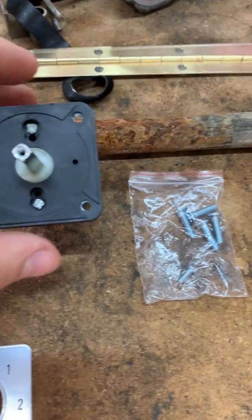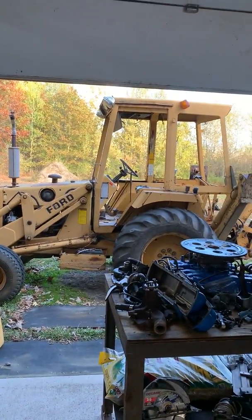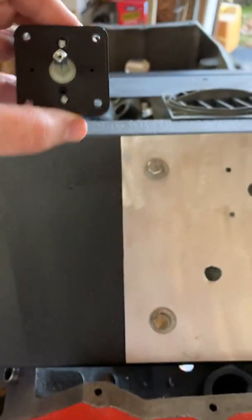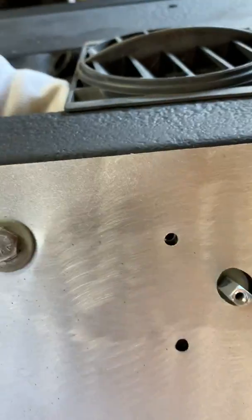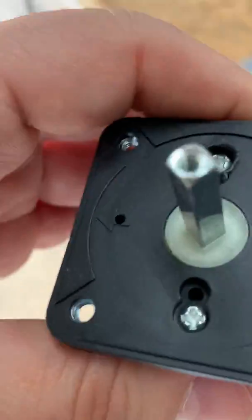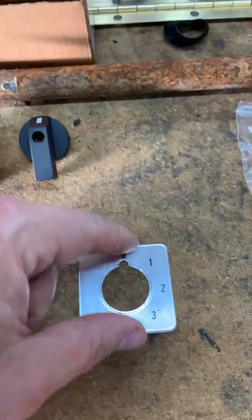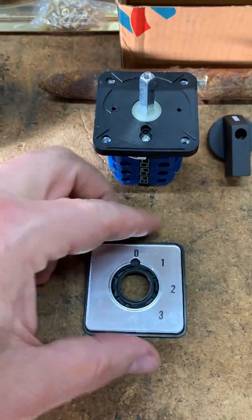That's where the four bolt holes are for the screws that bolt the cover plate together. To show my application: this is going to go in a backhoe for the blower motor assembly. I've taken a center hole that it fits into and put the four screw holes on it. It's going to mount on the back side, stick through like this, and then the four holes are where the bolts go through to bolt the cover plate to it.